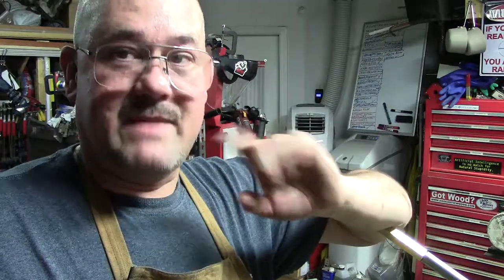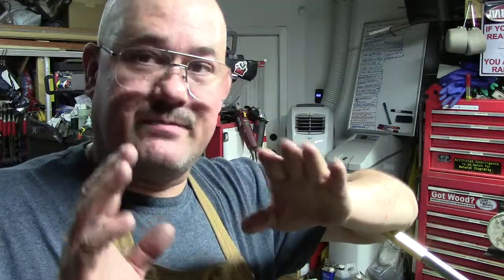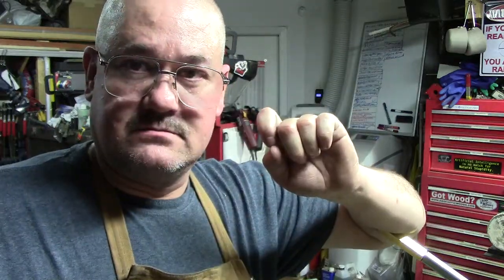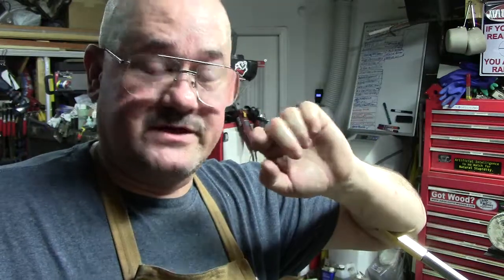So what I'm going to do first, before we make a cut or correction, let's take this as an opportunity. This is why I do the videos, guys. Before we make another adjustment, let's take one more light cut. Actually, let's go ahead and move 1/1000th away, and then we'll take a cut and we'll measure. Okay, yeah, let's do that.